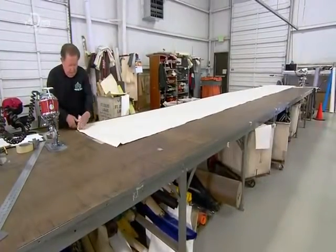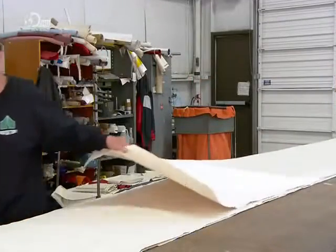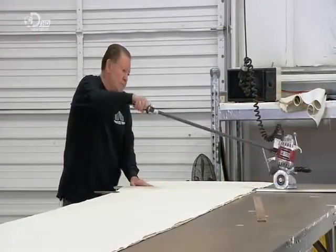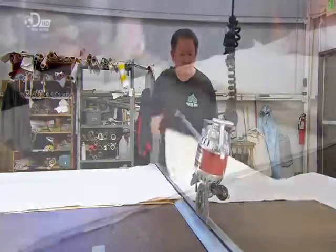Depending on the number of tent orders to be filled, the factory's fabric cutter layers up to 10 sheets of canvas on the cutting table. Following a pattern, he draws guidelines, then aligns them one at a time on a track along which the cutting knife rides.